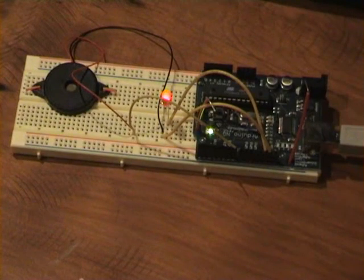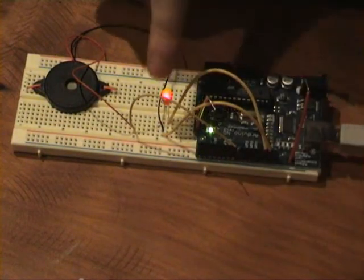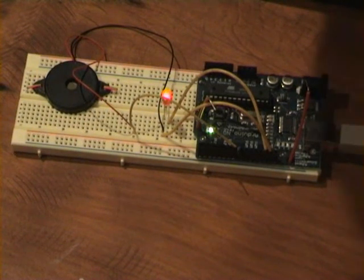I was looking into sound and how to manipulate it with the Arduino. Through Doug's recommendations, I came to the tutorials from Spooky. This is one on how to get a piezo speaker to work. Basically I've got the piezo running from pin 7 through to the positive of the piezo, back through to the ground. I've got an LED in there just so I know when it's running. This one works on the fact that you've got your musical notes, which are programmed in with the program, and you then feed it the data.